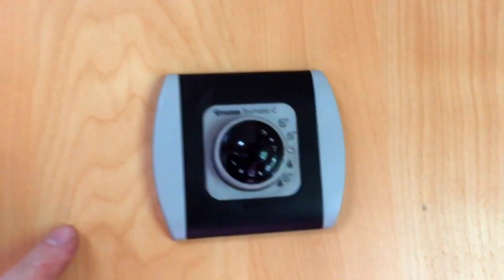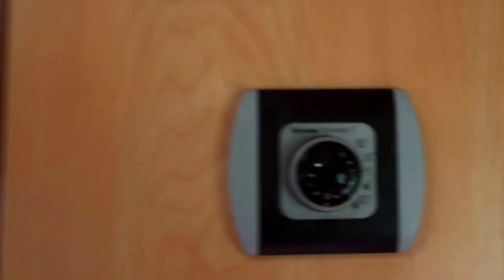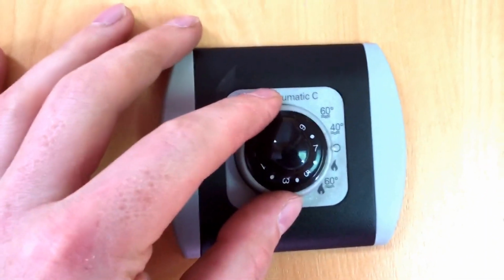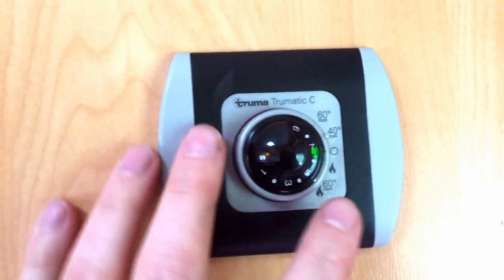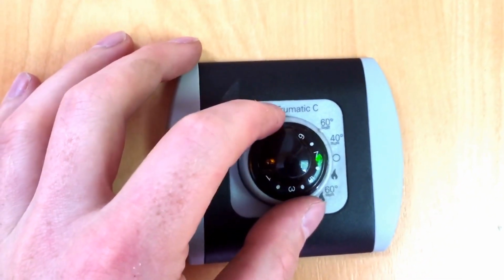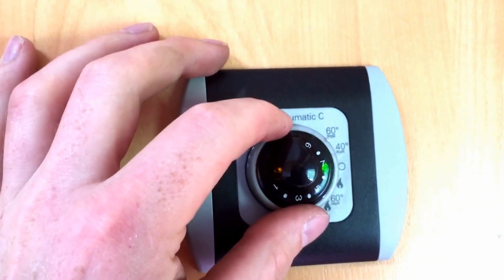This particular unit here is very important. This is in control of our water heater and of our central heating. Now, generally in the summertime, we will not need the central heating too much. If we want to use our water heater, there are two settings up the way. This is 40 degrees, which is generally the one that's most used, or 60 degrees. Once the green light is on, it means that the system is operational and everything should be okay.